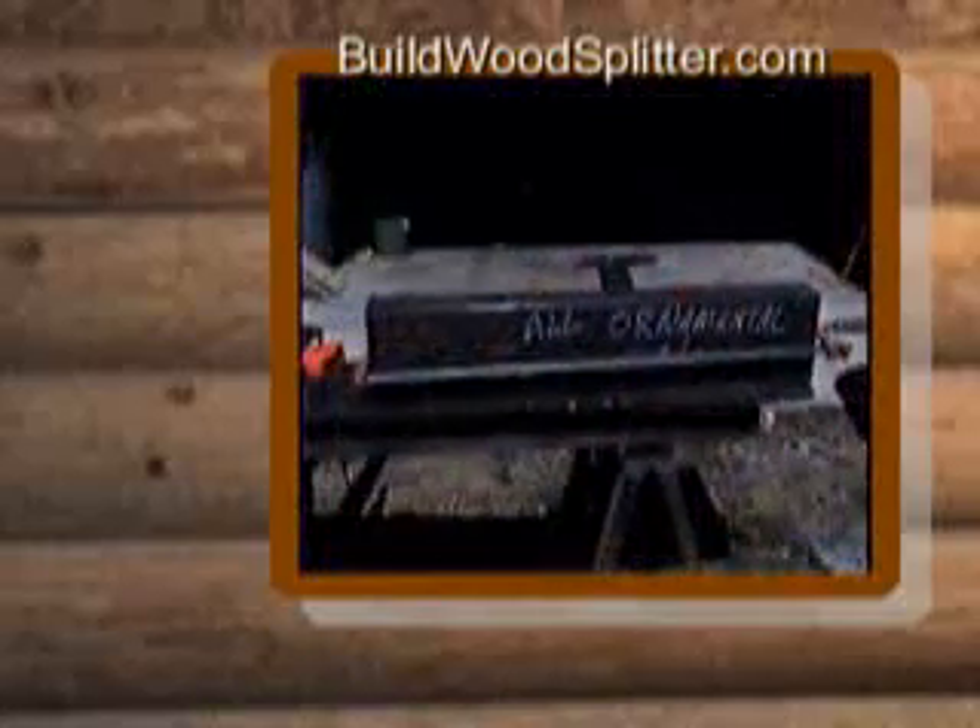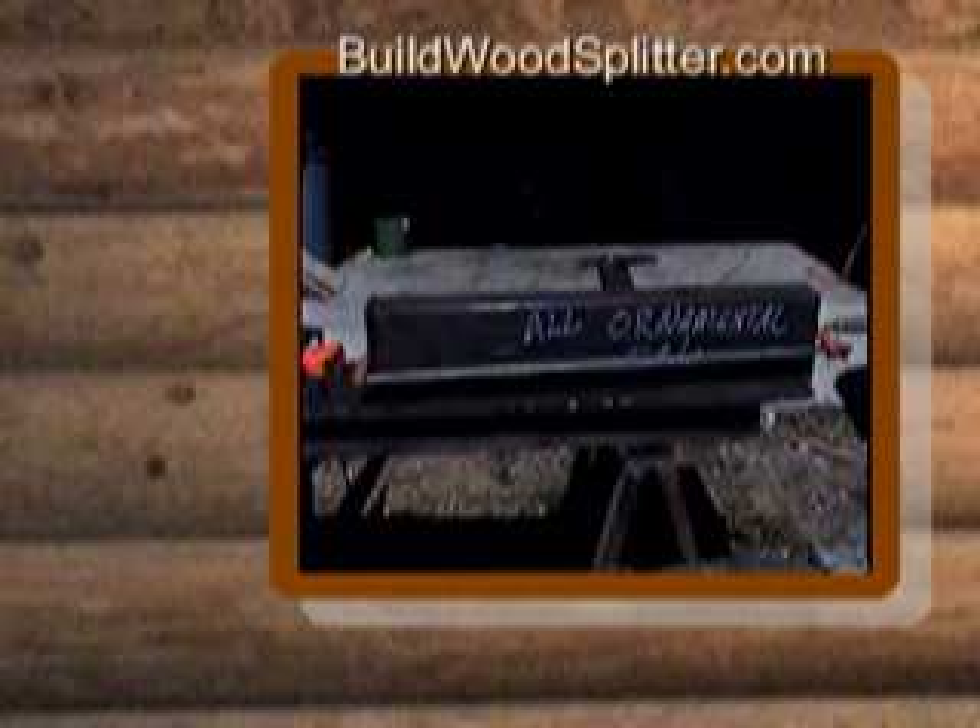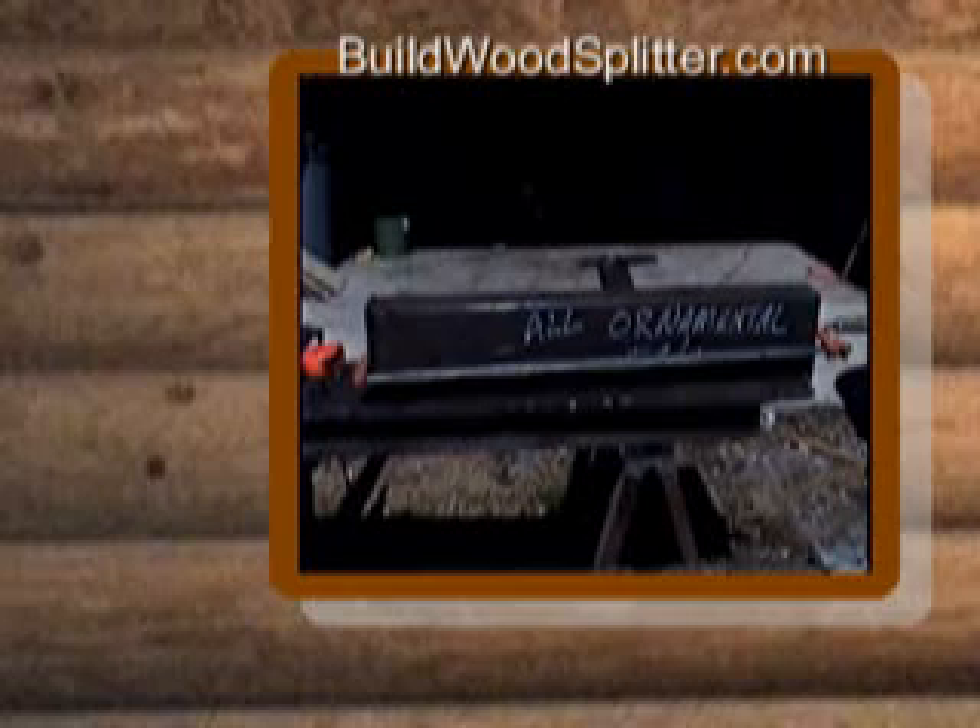Just to show you how I got this set up — I took a 36-inch long bar that I actually used for making log furniture, and I just capped both the ends of the tube and put the long bar on there and tightened it up, and now I can just weld that up solid. So that's how you can set it up.